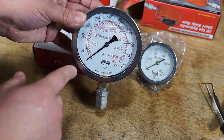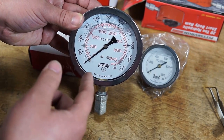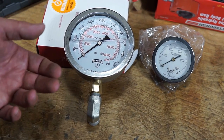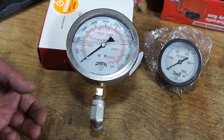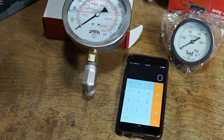This gauge is only good up to about 10 tons, but it's going to give me higher resolution in that range, which is why I purchased it. Ultimately, you're going to want to choose a gauge that gives you the most resolution for the pressures that you're going to be using. Now, we already measured the diameter of the hydraulic ram, which is going to allow us